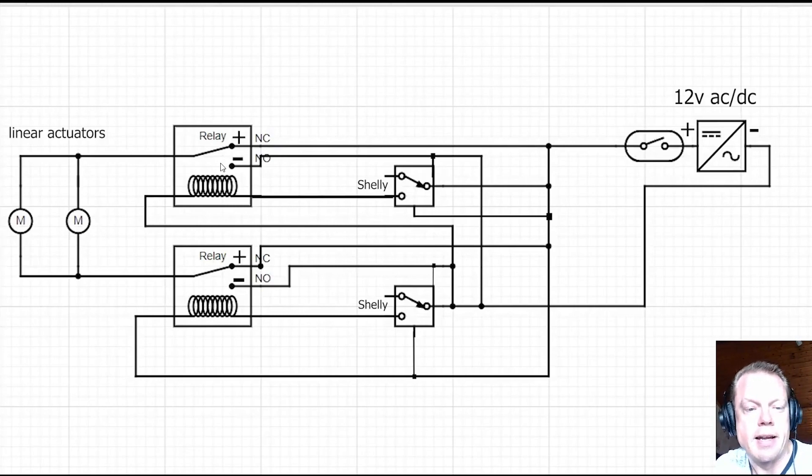When the sun has passed the horizon, the second relay is triggered via the Shelly relay. We then have negative on one side and positive on the other side, and the actuators start to backtrack to their neutral position — tracking for around 50 seconds, then standing there facing south the whole night. When the sun rises again, this relay is activated once more and the actuators track all the way back to east. At 10 o'clock the relay is active for six seconds, the system does its first tracking of the day, and everything repeats itself.